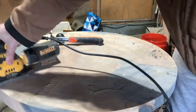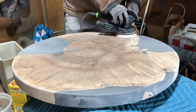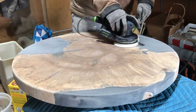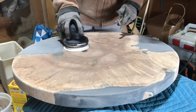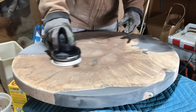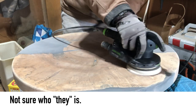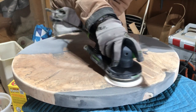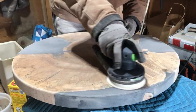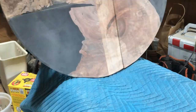I also added a small 45-degree chamfer on the bottom and a quarter-inch round-over on the top, which gives a really sleek look. For sanding: I use my dual-action sander right away when I get the piece from the industrial shop, since they leave zigzag marks. I go up to 80 then 120 grit with the DeWalt, then switch to my Festool finish sander and hit it with 180 and 220. I spray with water at least once or twice to raise the grain. The most important thing when sanding epoxy and wood is to have an air compressor and constantly blow off the piece and the sander — that really cuts down on pigtail swirl marks and speeds up the process.